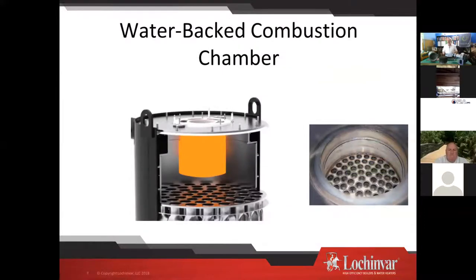When you do a service, you pull the burner out and look down at those tubes — you might be inclined to say you could get a brush in there, but you can't. As a general rule we don't take the top plate off, mainly because those heat exchanger combustion chambers really don't require that type of maintenance. If you do need to take them out, be cautious putting it back together — make sure you pressure test it when you reassemble, and we'll go over how to do that.